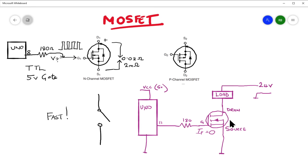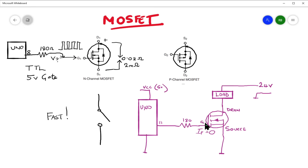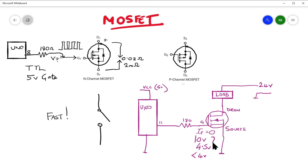What do we really have to think about when using MOSFETs? You do have to be careful about the maximum voltage between drain and source — here we're using a 24-volt supply. Being a TTL or logic-level gate, it will switch on pretty much fully at 5 volts. Some can go below 4 volts and even switch on at 3.3 volts, which is useful for things like ESP8266s and other microcontrollers requiring low voltage. Look at the datasheet for the VTH parameter — this tells you the threshold gate voltage needed to turn it on. VTH is sometimes also listed as VGS.